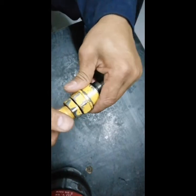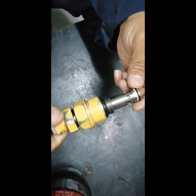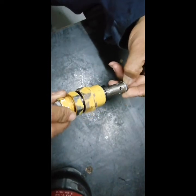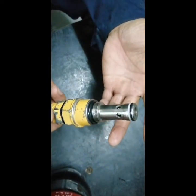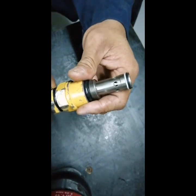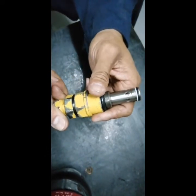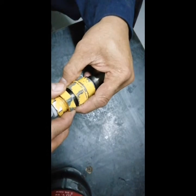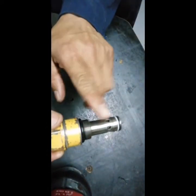This part is not very difficult to repair — it's very simple. But it is the main part that protects and controls the maximum pressure, protecting everything in the hydraulic system of the excavator. Without it, you cannot regulate the pressure to normal levels.